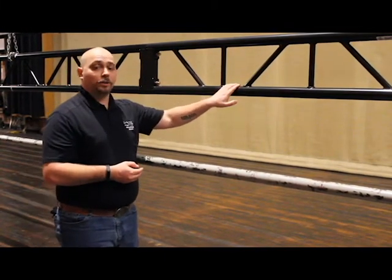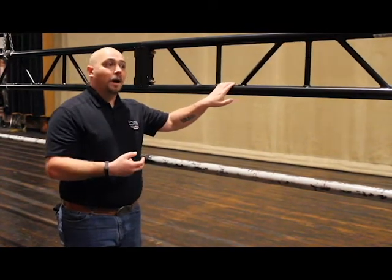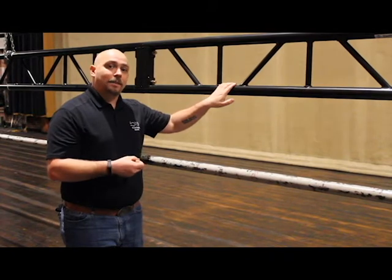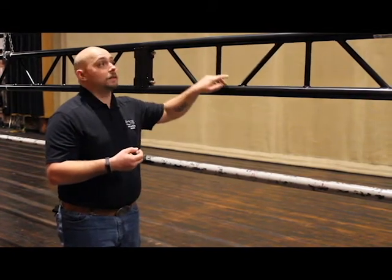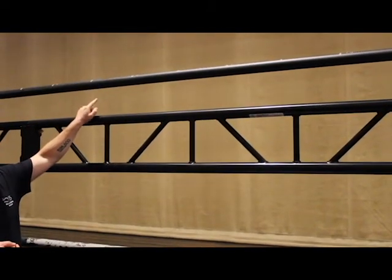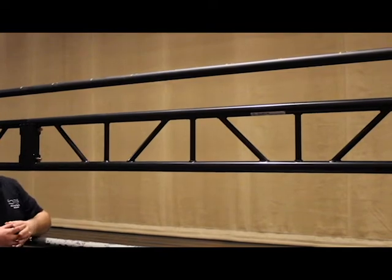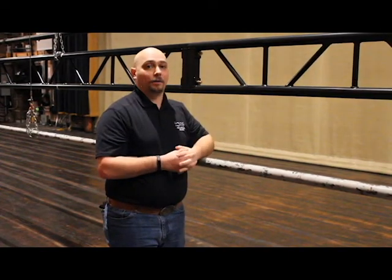The solutions they've come up with in this theater are using ladder truss. Ladder truss is a wonderful solution as far as taking care of the deflection issues, but it does have some idiosyncrasies that can make it a little difficult to work with. The other solution in this theater is 2-inch schedule 40 pipe. The problem with 2-inch schedule 40 pipe is that its diameter is so large that not all moving light clamps will fit on it. So moving light clamps tend to have to go to the ladder truss in this theater, or to the old pipes if there's not another option.